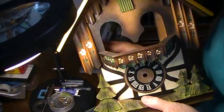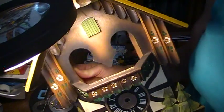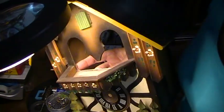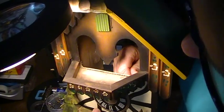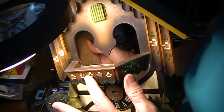All right. So there's little staples in the wood right here on the side of this balcony, and it's a little wobbly where it's been laid on its face before, so I took this rolled up bubble paper to lay it down and try to give it a little bit of cushion, not put more weight on this. And I can see inside the wood right here, there's a crack where it's started to break loose. I don't feel the staple on the inside. I can feel that one a tiny bit. So this side's pulled out just a little bit. And I may just take that off and put some wood glue under it and then put it back on to hold it secure. I don't want it wobbly.